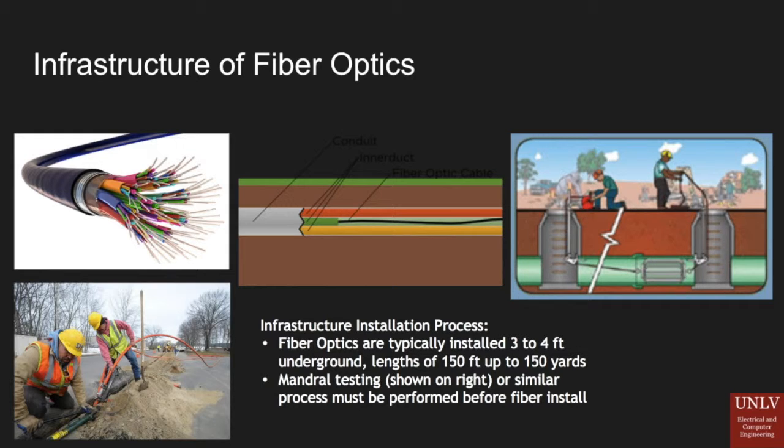The picture to our right shows a modern version of conduit inspection where they are fishing a device down a conduit pipe in order to see if there are any blockages. This device has motors, high-definition cameras, and lights. However, these devices range in price from $11,000 to $35,000, which is too expensive for industry standards. This is why most typically don't use them and resort to less efficient methods like yelling into the pipe to check for an echo, or using a vacuum to blow air into the pipe to check for pressure buildup, which is not very efficient and can cause a lot of issues.